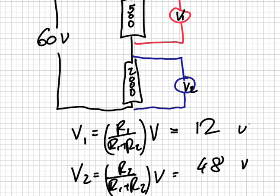What's the answer at the back? It's not this? 10 and 40. It can be 10 and 40. They don't add up to 60. Did you use the internal resistance for the voltmeter? It's 2,000. It's 500, but it's 2,000. I got the same answer as you. What did you say the answer back was? 40 and 10, yes, which is 50. So is it possible that in the question they meant to say 50 volts instead of 60 volts? Because everybody else got these two numbers.